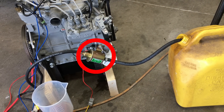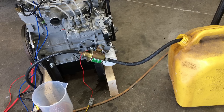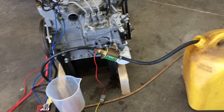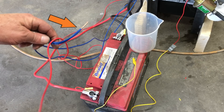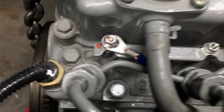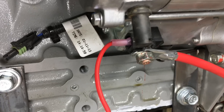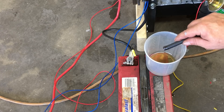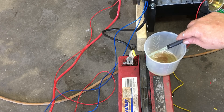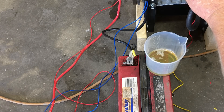Fast forward a bit, and now we have a little electric fuel pump temporarily attached to the engine. This little pump will transfer fuel from the container to the high-pressure fuel injection pump. Since this pump is something I had lying around, it's probably a good idea to purge it in case it might have some gasoline in it. Over here we have a temporary wire connected to the glow plugs on the engine, and a wire goes to the starter solenoid to engage the starter. Now let's purge the lift pump and get some diesel fuel to the injector pump — this seems to work fine and is certainly pumping enough fuel. So now we can connect the fuel line to the injector pump.